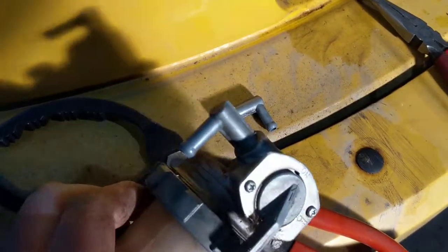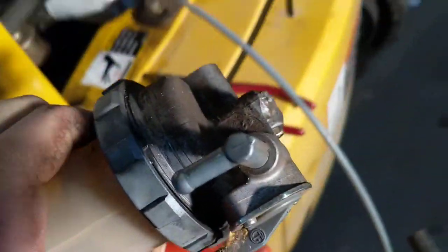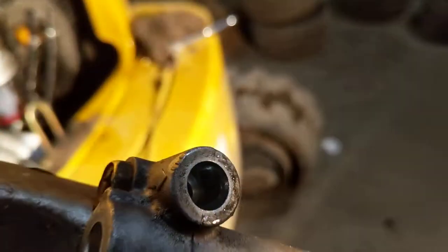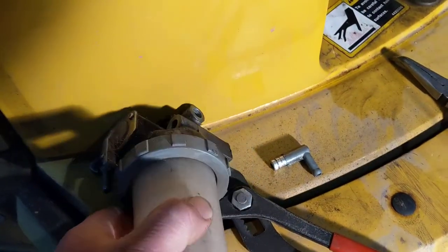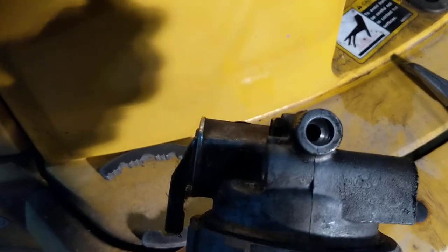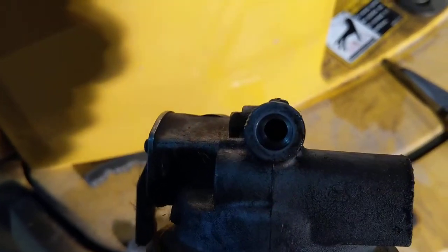There's no o-ring, nothing like that — it's just pressed in there. Anyway, not really repairable properly. You could probably Mickey Mouse it, but the other option would be to drill and tap that and thread in a barb.